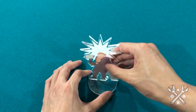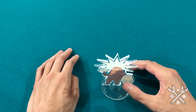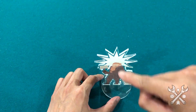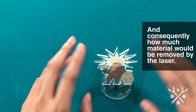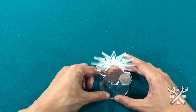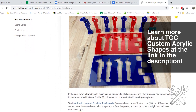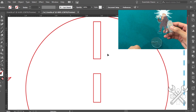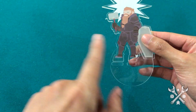So as we fit the figure onto the base, we can see that there's a little bit of wobbling. The reason I believe that is because I didn't account for the kerf, which is to say the thickness of the laser as it's cutting through the material. Because the kerf works two ways, in a sense — it's the reason why the pieces were falling so easily out of the sheet. There's a little too much space, so the pieces don't lock together. If I were to redo this, I would probably make these gaps, or widths, slightly thinner — perhaps subtracting two times the kerf on the SVG.